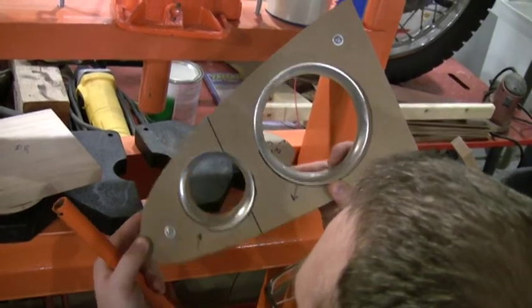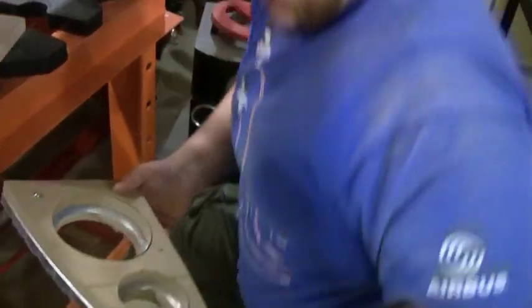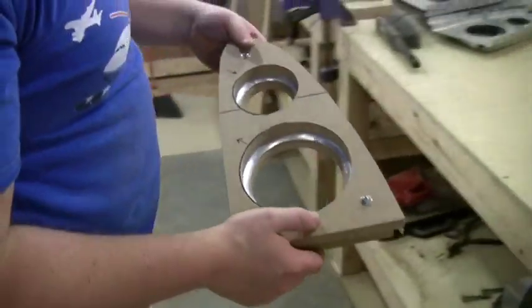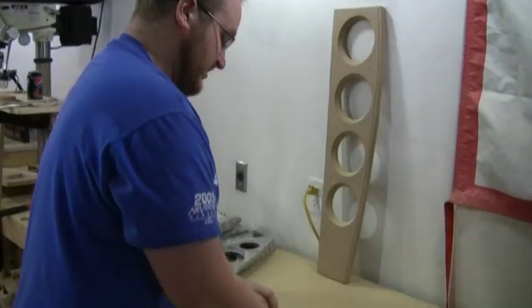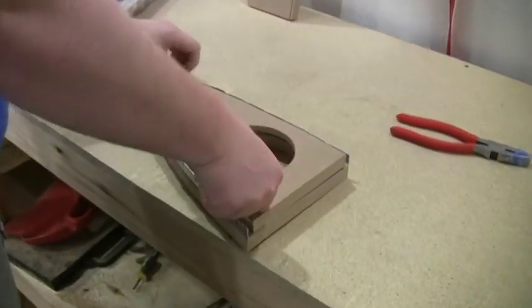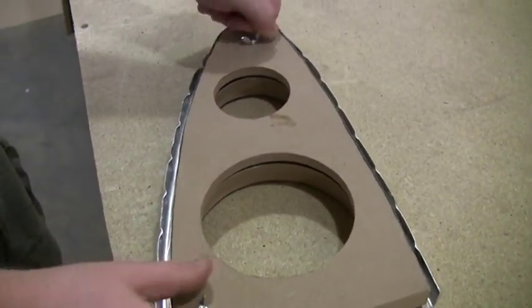Looks like another beautiful flange. That goes quick once you have the dies made. Some people use a stick to go around and do their flange rather than a die, but what's nice about this is it's even pressure all the way around with that press, so it should be a pretty even flange all the way around.